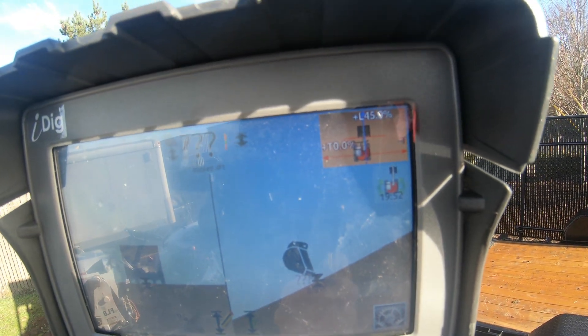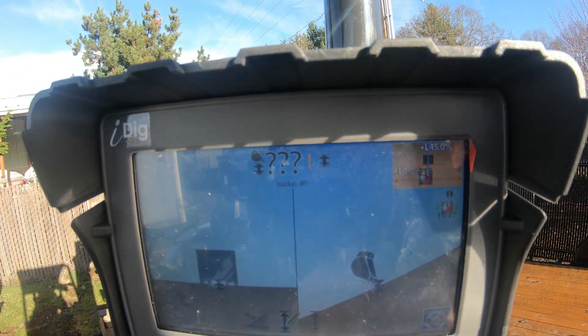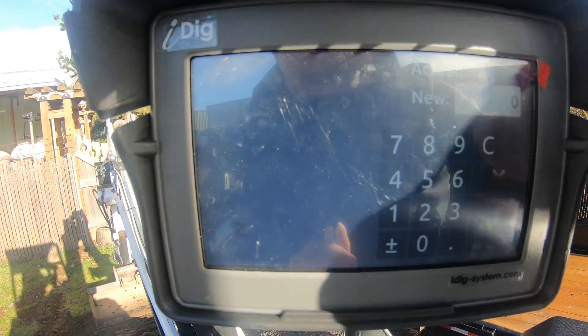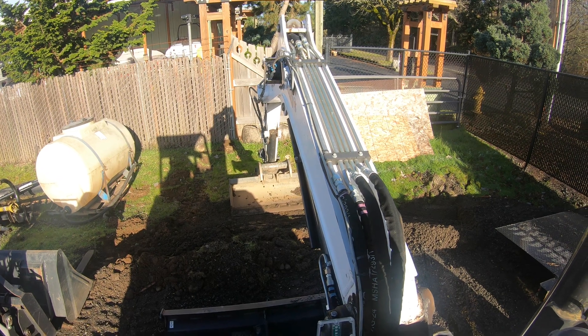It aligned pretty quick there, and you can see we're at about 90 degrees or perpendicular to the slope, as I haven't moved the bucket since I clicked align. And now I'm going to tell it to zero where my bucket's at, so I just have my bucket flat on the ground.